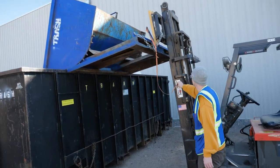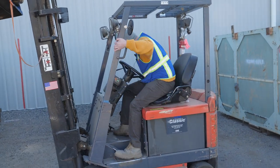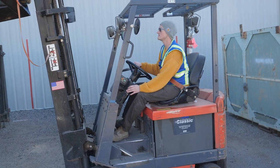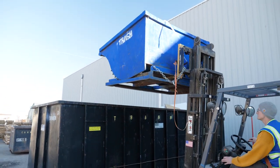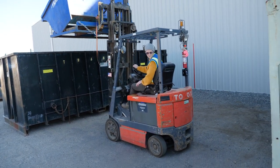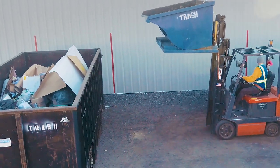From there, I'm going to get back on the forklift using three points of contact, turn on the forklift, tilt the hatch back, disengage the parking brake, look back twice, then reverse until I can clear that dumpster when I lower the mast.